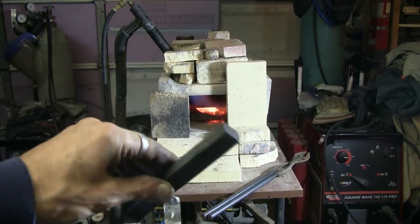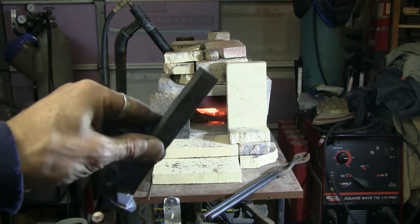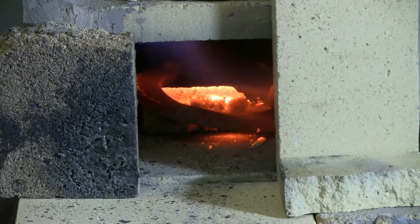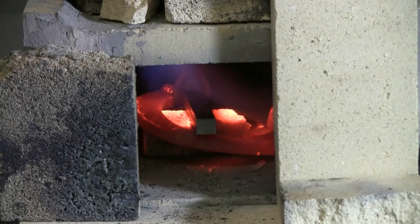While the horseshoe is heating up, I took the railroad spike over to my bandsaw and cut the point off it. The horseshoe is beginning to heat up, and the spike's now in there as well. What I'm going to do with the spike when it's heated is put a twist on it. Then all I'll have to do is weld the twisted and ground spike to the horseshoe.